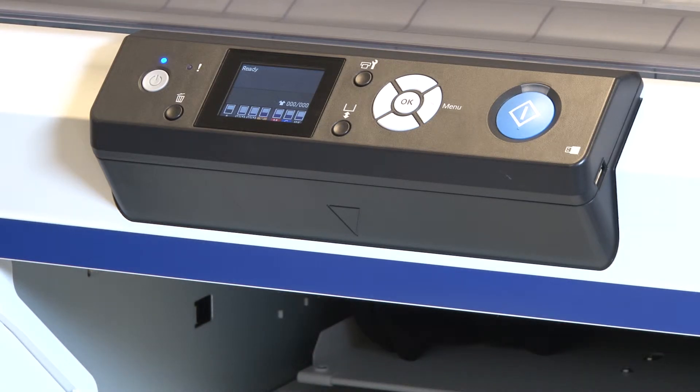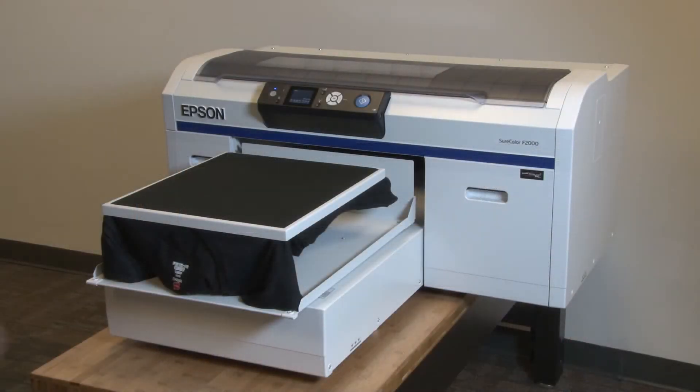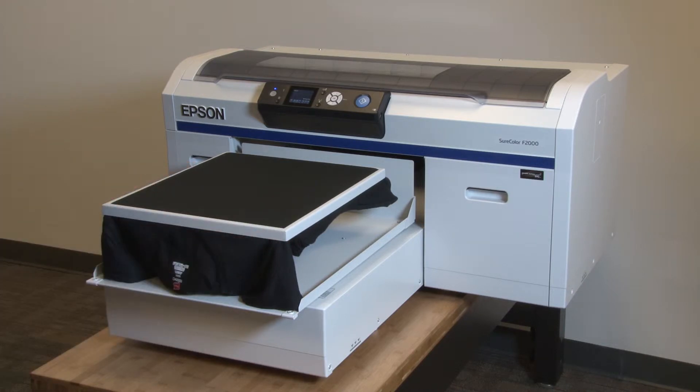I now get a ready display on the control panel. I have now determined that two, the first height to achieve a ready, is the minimum platen height for this t-shirt. It is important to remember that two was obtained against a perfectly flat garment surface.